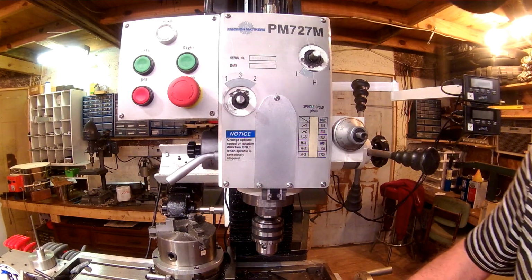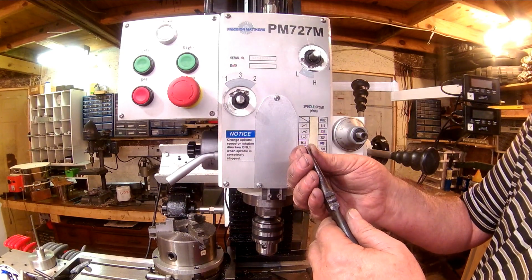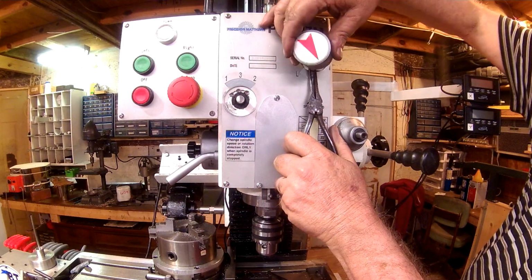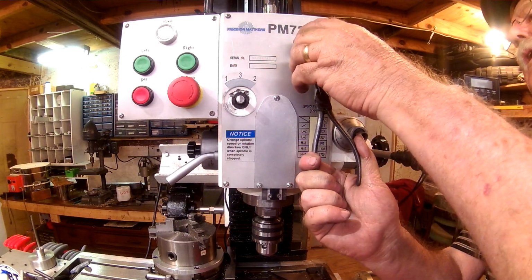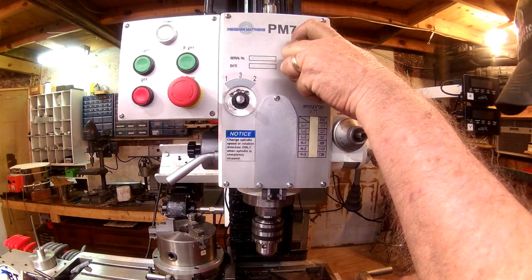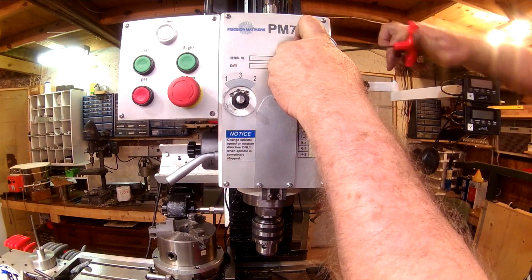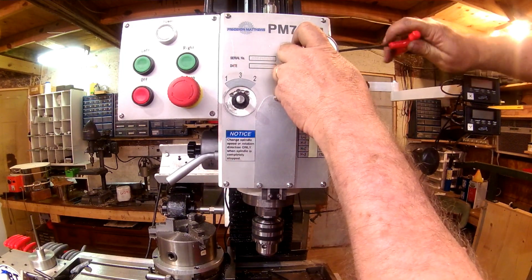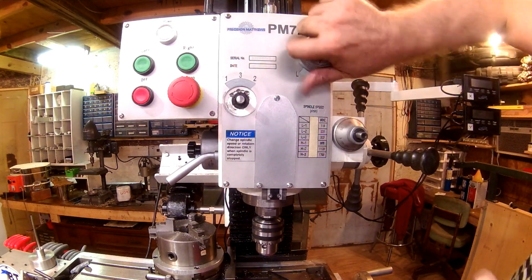Now again, we want to be extra careful with the ball bearing. The two knobs are just alike. We've got some very fine needle nose here, and I know I had this in the high position. So I'm just going to locate that ball bearing in that high. Press it on there. Press and hold. The set screw will find its home when you get it close. So lock that one down plenty tight. And the ball bearings will work.